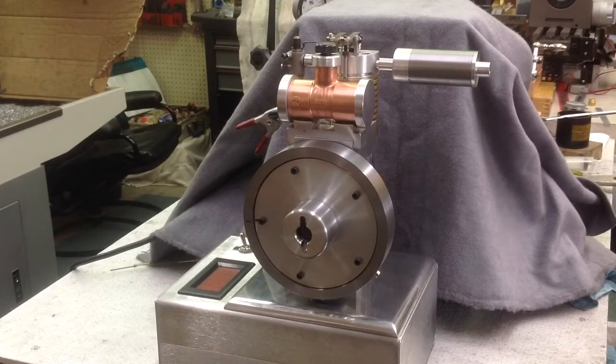The bore is cut down just a little bit — I think it's around 950. I have the same stroke as what was in the plans, but a smaller bore. I had to notch out the bottom of the cylinder to accommodate the swing of the connecting rod.